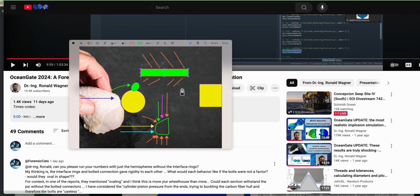But what happens if you just model the carbon fiber with plugs at the end with no pressure coming in at the end? How does this behave? Is it going to shear there, wherever you think, however big you make the plug, and will it shear there in the other end? Or if you can put a defect in there in your layers, I don't know how complicated that is, you'd have to pick one spot. I visualize it's punching through, that it's making one zone where it can punch through because of the way they did their layup and sanding.